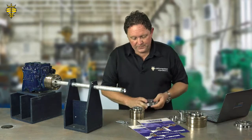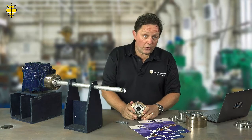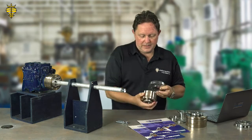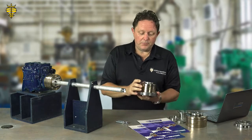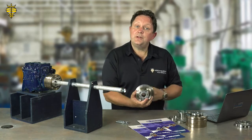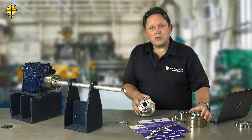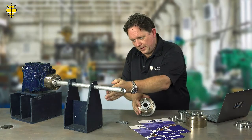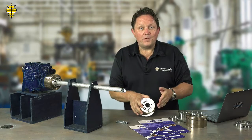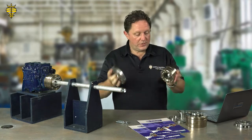Once you get to the crossover point — kind of like a 50-foot boat depending on the engine — you may find the boat is within the torque range of the units but the diameter is wrong. So we have a series of adapter flanges, and we can send you drawings — it's actually in the report — where you can modify the four-inch flange to fit on a five-inch coupling. The nice thing is, because they're completely hollow, you don't need to trim the shaft. Normally with a coupling like AquaDrive you'd trim the shaft to fit the thrust bulkhead, then you'd need an intermediate shaft. None of that here. You don't need a keyway. You can have a shaft made and just leave it rough, just chamfer the edges. As long as you can slide it into the coupling, everything else is completely hollow, which just makes installation a dream.